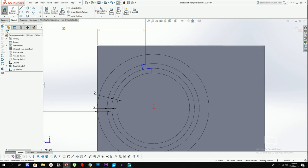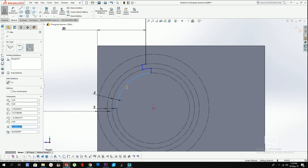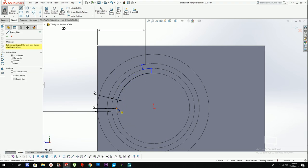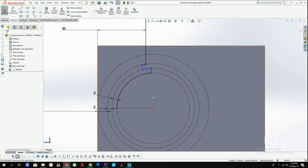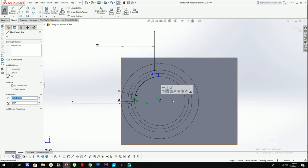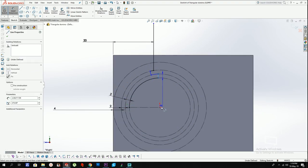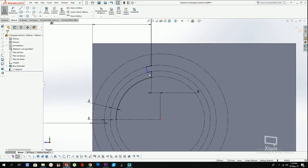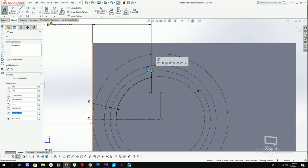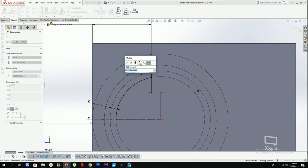To make more space for the centers, I'm going to make a V-mechanism. Instead of creating a hook that goes straight into the center, you create a hook that goes backwards and then inwards again. What that does is leave more space for the screw inside the center and more stability, because there's a larger rim — a larger space for the piece to hold on to. This is what's going to hook the piece into the center. Now let's go back to the center of my axis.